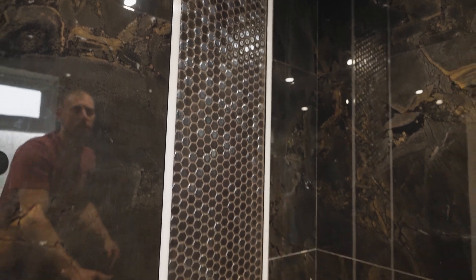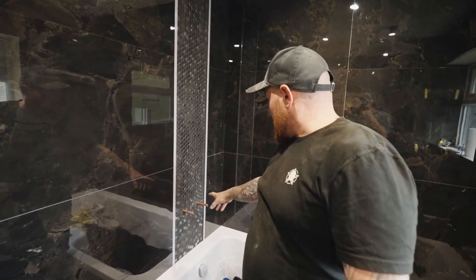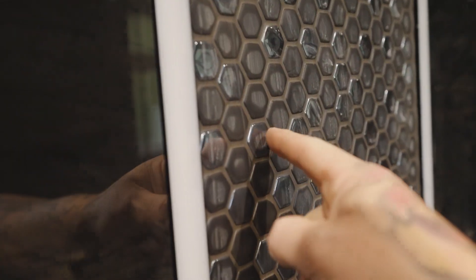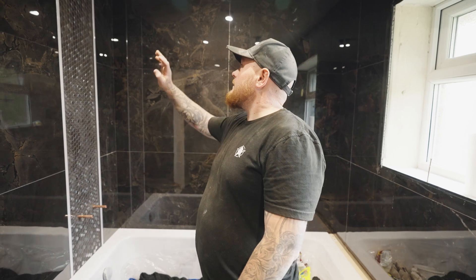It's best to leave that to dry now. Don't worry if there's a little bit more grout on the surface — when it's dry it'll just turn into dry dust and we'll wipe it off. You can see how it's starting to dust off; it's not quite there yet but it's getting dusty. We'll let that go a little bit more and then Andy's going to clean that off.